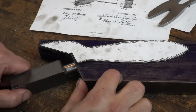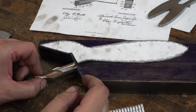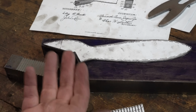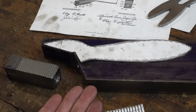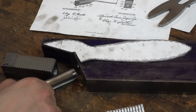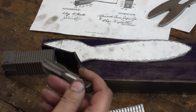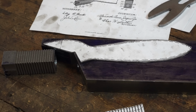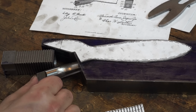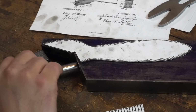Yay. Second part. I decided to drill this hole 5/8 even though it needs to be tapped and is now too large for my 5/8 taps, unfortunately. So I have the option of using an 11/16 tap in here, but the rod that's going in here does not have the appropriate die. So I will either need to purchase an 11/16 die, or I can use this pipe thread. It's a 3/8 NPT pipe thread in there, and I do have the die for this that I can use for the rod that will be going in here.